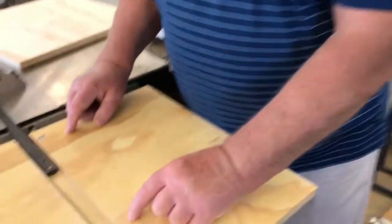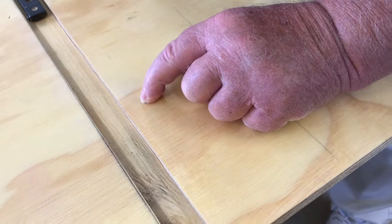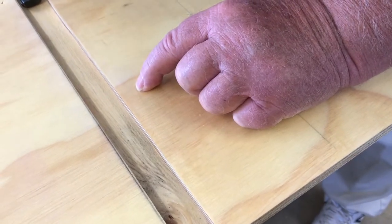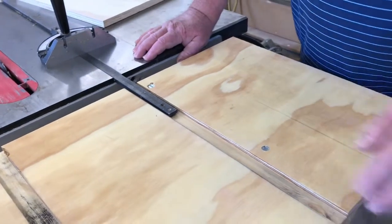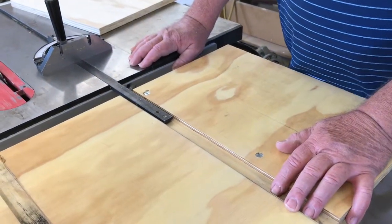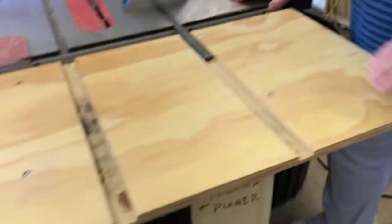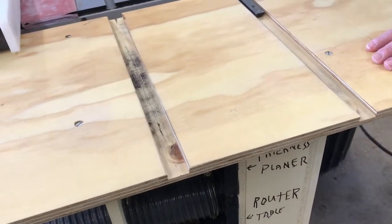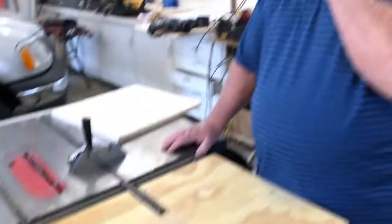One more important thing: I put screws into here and this is screwed down with threaded inserts, so I can take this top off anytime I want to get down into the box to unhook a saw hose or do what I need to do in there. Then put it right back on — since it's threaded you can't mess it up. That makes it more serviceable in case a large piece of wood or something got in there and you had to work on it. Anyway, have a great day. Say bye, dad. Bye! We'll see you next time. Bye bye.